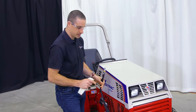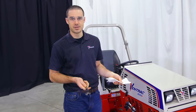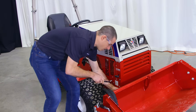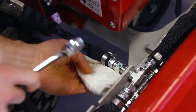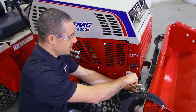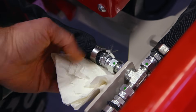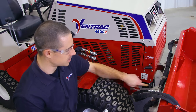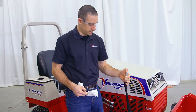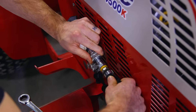What you want to do is follow this line to the attachment where it tees in, and break that nut free to let the pressure loose. It won't take much — only a couple of drips of hydraulic oil will come out — but have a rag ready so you don't get any on the ground. Take your three-quarter wrench and move it free. You could hear that pressure release. Then tighten it again — go from finger tight to about one to one-and-a-half flat surfaces tight, taking it one whole flat surface distance, as there is no torque value for these. Now you can see the plunger moves easily with finger pressure, with just a little bit of oil squirting out. Wipe that off and you'll be good to connect it to the tractor.